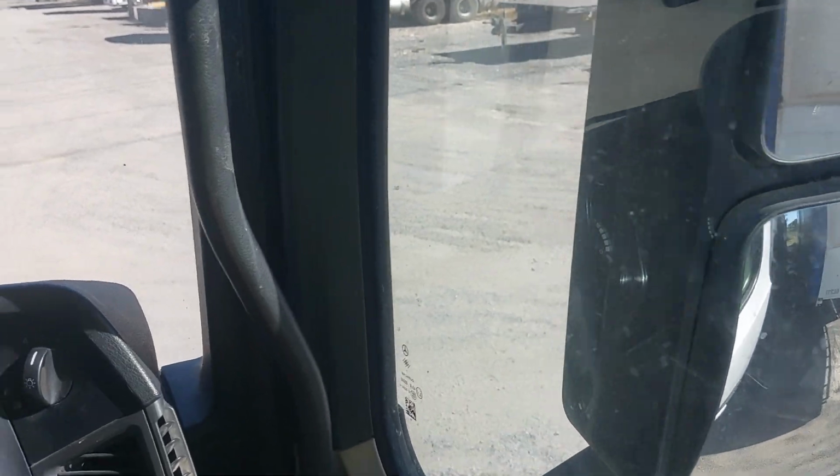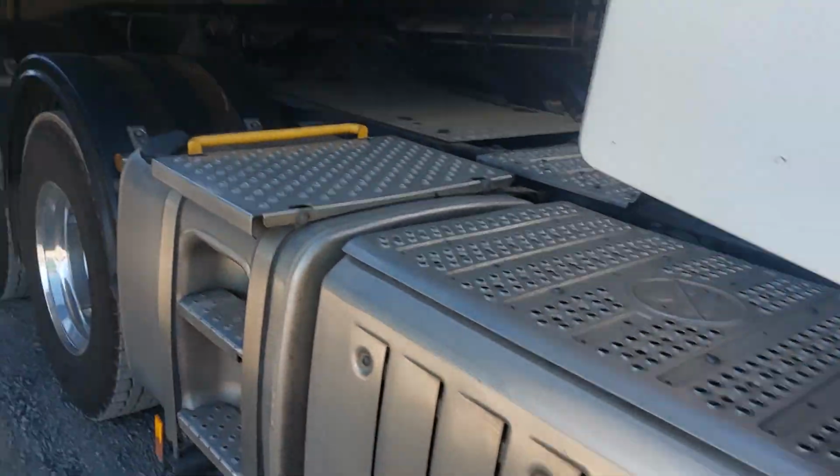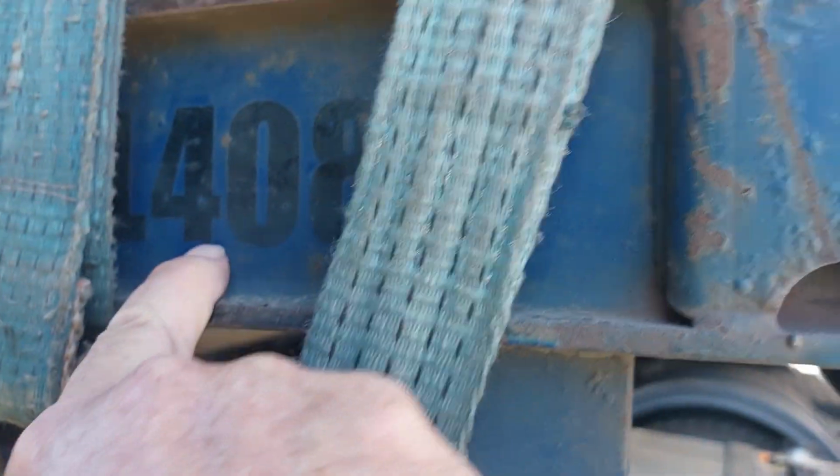So I've got to collect trailer 408, so you always make sure that you've got the right trailer. As you can see, I'm right up in the air. You can see the suspension's right up. Go to the back, double check trailer number. Right, 408. The right trailer number. Go under. Just in there, you may not see it. Yep, see the little silver bar? That's got to be across. If it's not, the pin isn't engaged.